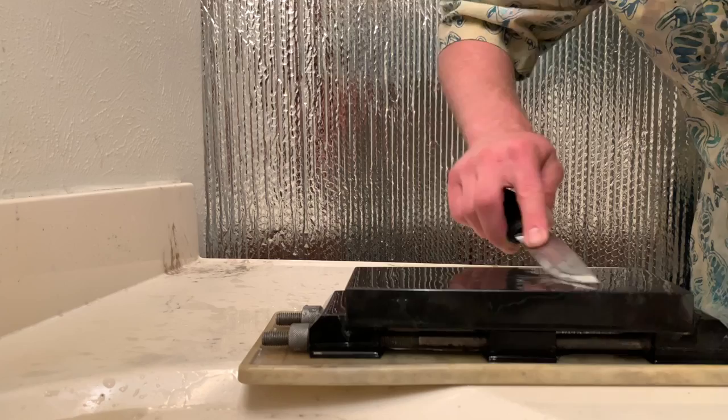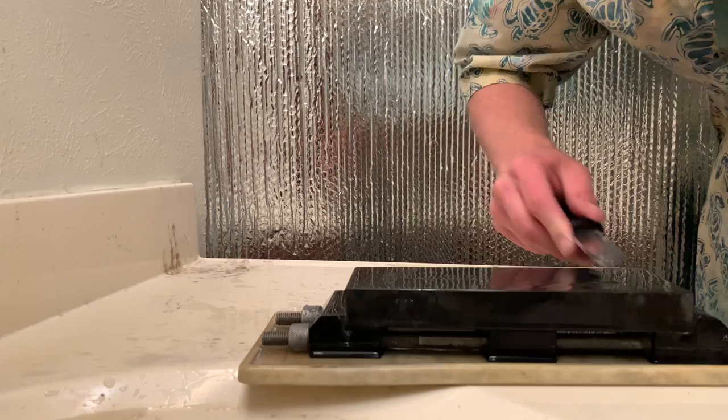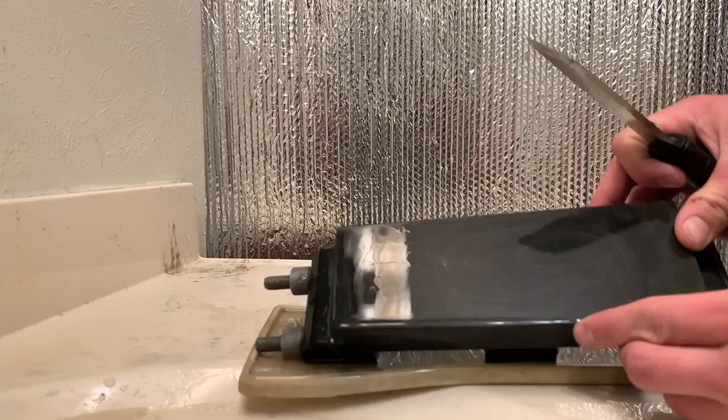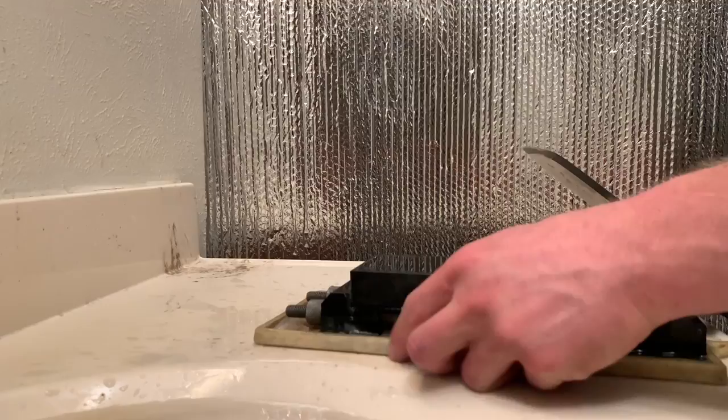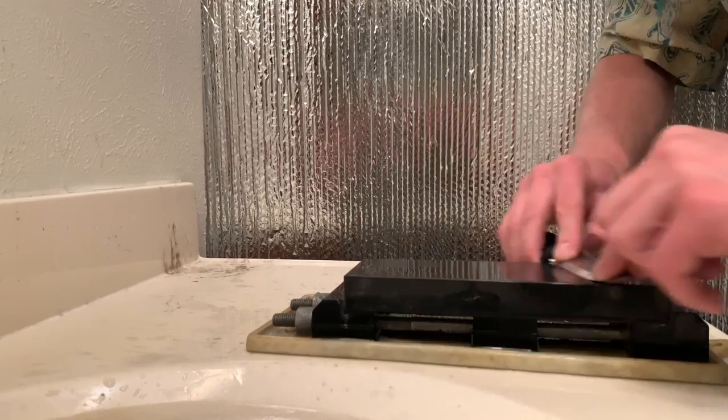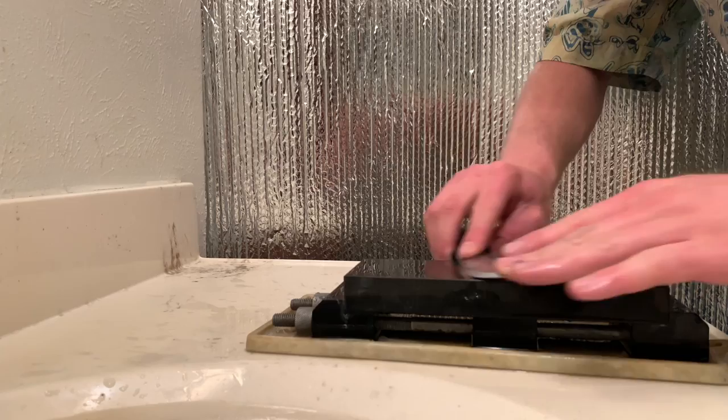An interesting point to make is that although I seem to have covered the whole surface of this stone at least a few times, the steel pattern is still happening in new directions. So you can see all the circles I just did, whereas at the beginning I was doing very linear strokes. And I would say that the cutting action of the stone is still quite efficient. The pores are still open. That's pretty great for about 25 minutes of continuous sharpening with pressure.